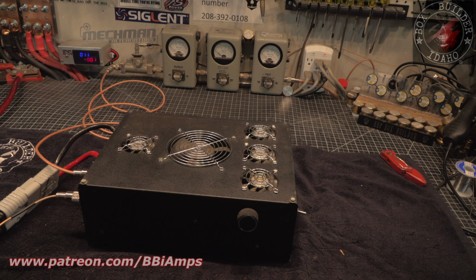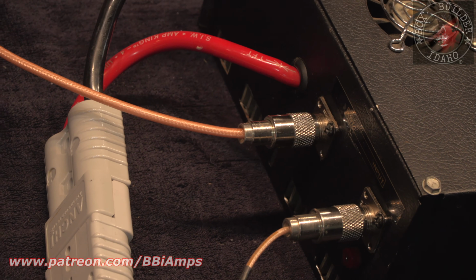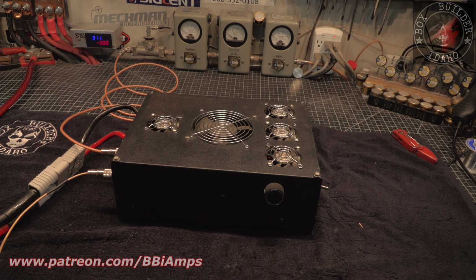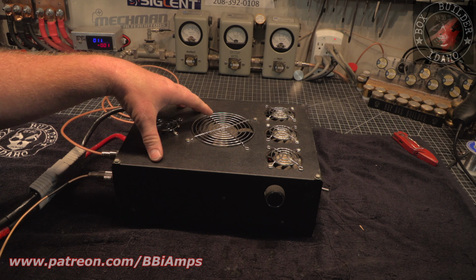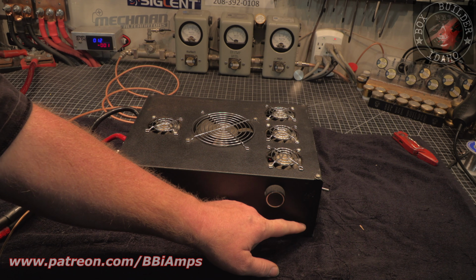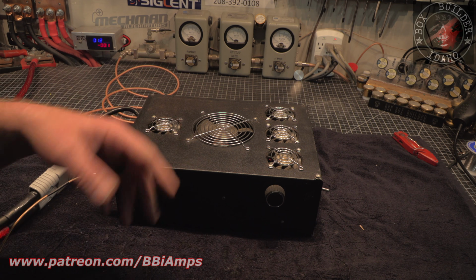On the back side of the amp, we will take note that down here there are just little grooves, which is better than normal. The normal situation for a Dominator style box like this is they drill some holes across the back and then call it a day. And that worked good for a lot of years. We've just found there's really better ways to do things today. That's why we just have a complete slot for stuff. But what happens is there's too much drag of the air going down, so that air comes in through the fan, goes across the components, goes to the edge of the cabinet, makes a 90-degree turn, then makes another 90-degree turn, and then it's got all the drag, what I like to call back pressure.